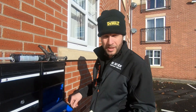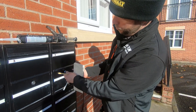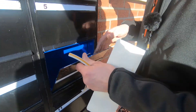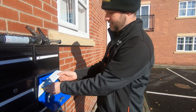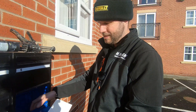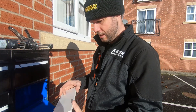Okay, what we've done with this - first of all we tried some weatherstrip seal on the bottom of this door here but we found that when it closed it pushed the door up and we couldn't get it open again. So we've stuck a bit in there, just almost like a lip if you like, so if water tracks in it should keep it to the front and just trickle down. But as another precautionary measure, we've made this little bit of false floor - just a little bit of plastic we're going to fit inside. That'll keep it raised off about 8mm anyway, so if water does get past that, hopefully all the mail will stay dry. We'll put a couple of blobs of silicone on just to hold it in place and that's that one hopefully done.